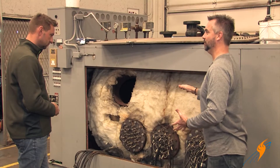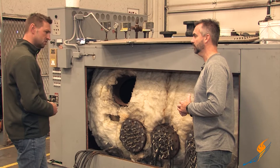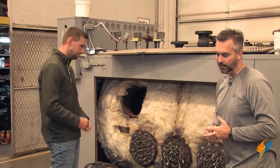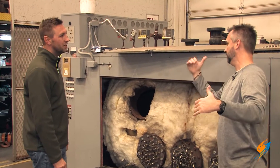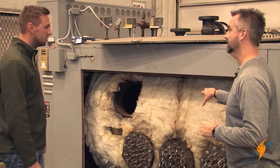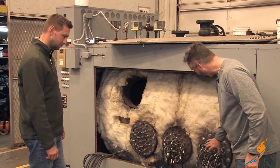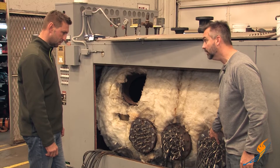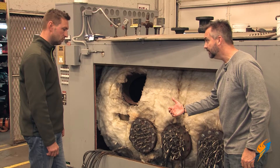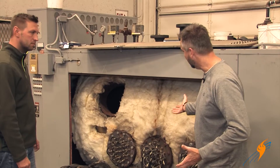I'm assuming the amperage load on this is pretty high. Yeah, this is about a 1800 amp unit at 460 volt. So when these things come on, I mean, lights dim. And again, 150 PSI design. Each one of these wires, then, is actually wired to an electrode that is heating the water up, getting us the steam pressure that we need. And again, capable of up to about 5,000 pounds per hour on this boiler.